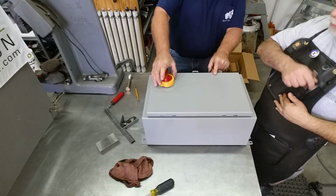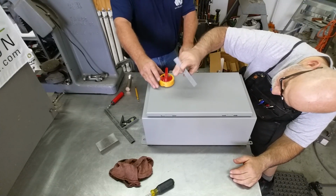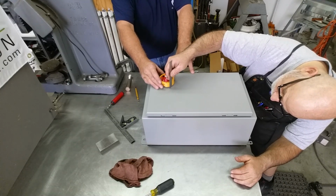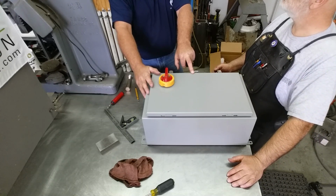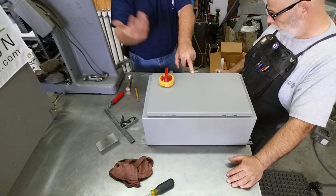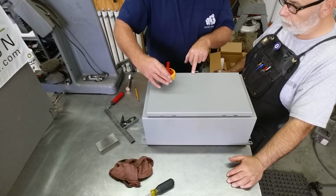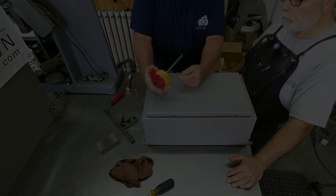You're all the way down here, and we're real close to fitting there, but we've got a little bit of gap. So all we're going to do is measure there. It's about 3/16. Okay, so let's add maybe 1/8 of an inch or 1/4 inch to that. Okay. And then we're going to take that much off the rod, and when I pull this out, we're probably going to get the rod with it. We're just going to lop that off the raw end of the rod.